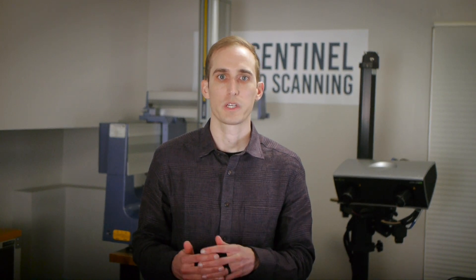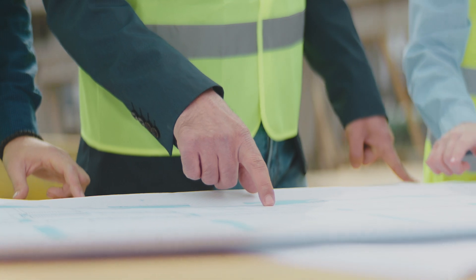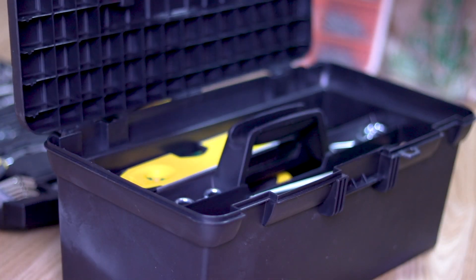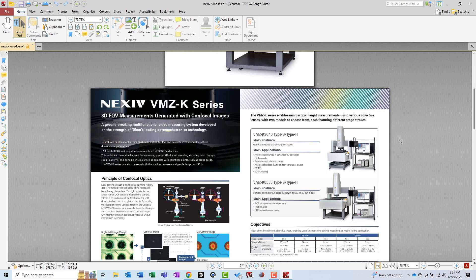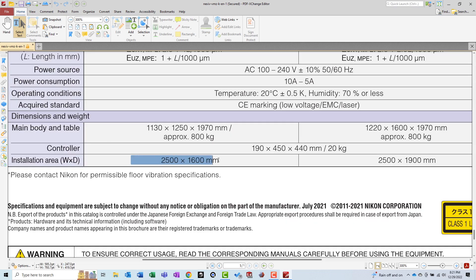Although it seems obvious, let's also talk about the size of your lab space. When finding or speccing out a space, consider footprint size, ceiling height, and door size. The footprint should be large enough to accommodate current equipment plus any equipment you plan to purchase in the future, and also large enough to allow for servicing of your machines. Most machines require regular service such as calibrations, repairs, and preventative maintenance, and service technicians may require access to the back and sides. Some equipment manufacturers even specify how much space should be made available for a given machine.